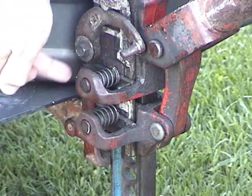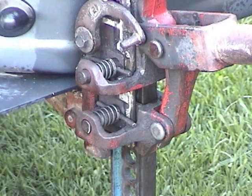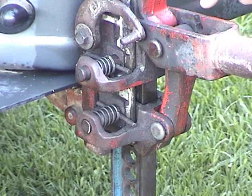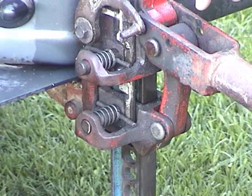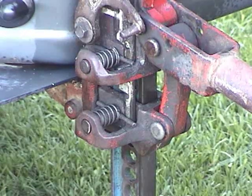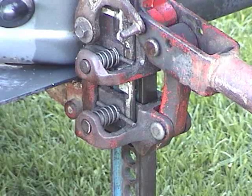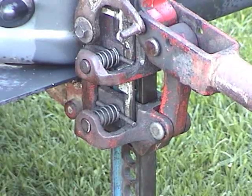These two pins down here play a very important role in the function of this lever. When I lift the truck by pushing on the effort end, you'll notice our truck is moving up quite nicely. When I get to this point, that pin moves in and locks into one of the holes on the sides of this shaft.